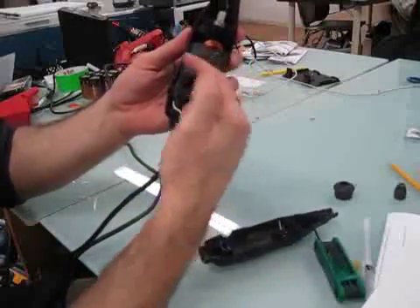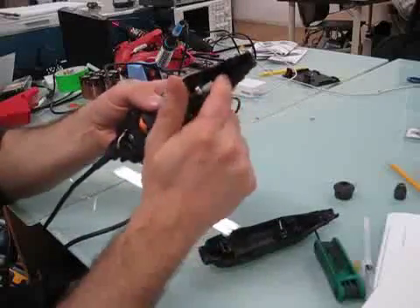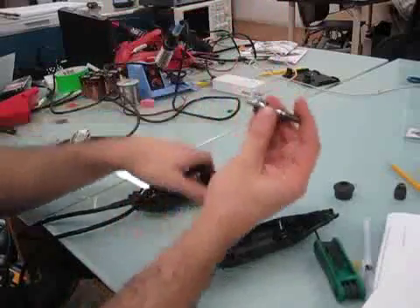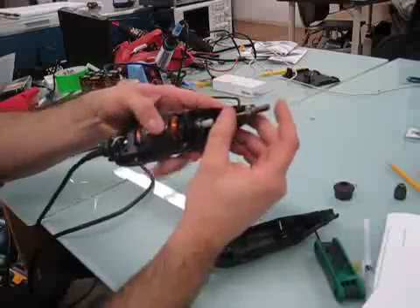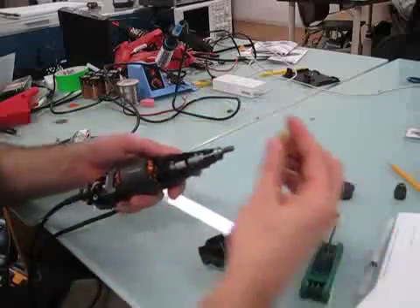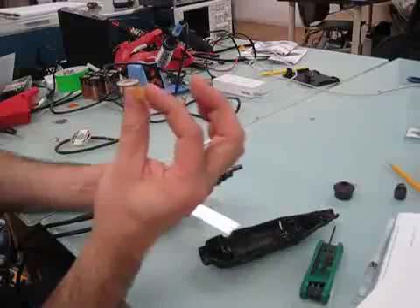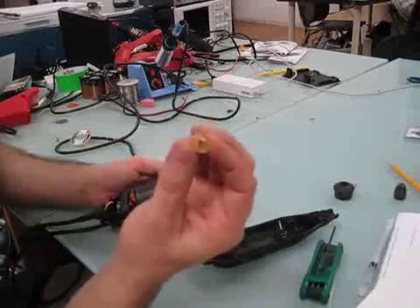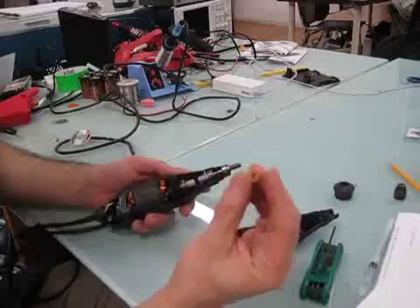Here's where the power comes in. This is the motor, that's the little cooling fan, and this is the drive shaft. This is the other half where the tool goes. Notice how they both have these ridges on there. When I opened up mine, what I found was there's a little piece here — this little coupling. It's just a piece of rubber, and if you look close, you can see this one's in pretty bad shape. It's chewed through, it's yellow, it's cracked, the teeth are messed up, etc.